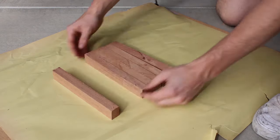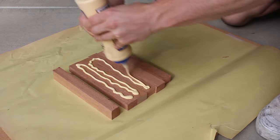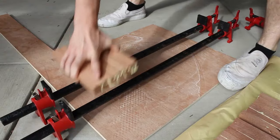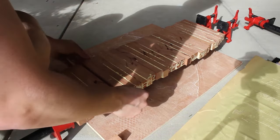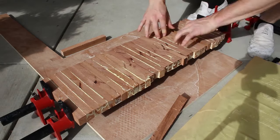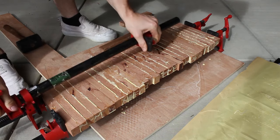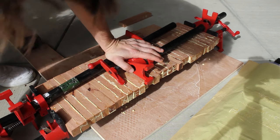Next I laminated my pieces together in increments of six, and looking back I might have done seven or eight strips to make the final cutting board wider. For this project I'm using Titebond 2 glue, which is FDA approved, food safe, and waterproof — you can also use Titebond 3 if you have that on hand. Before tightening everything up, I squared up the sides as much as I could and double-checked everything was as flat as possible. Scrap pieces and a mallet work great for this. I also didn't have clamps long enough, but connecting two pipe clamps together worked out great.